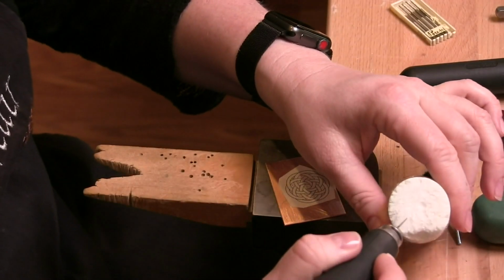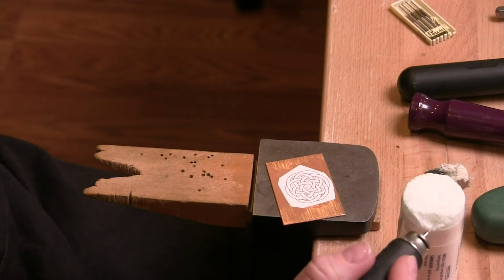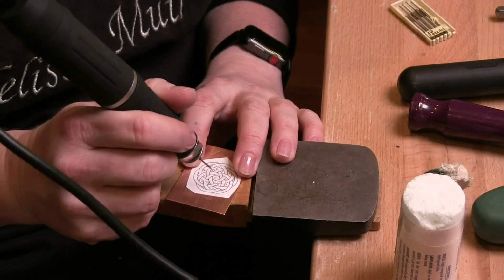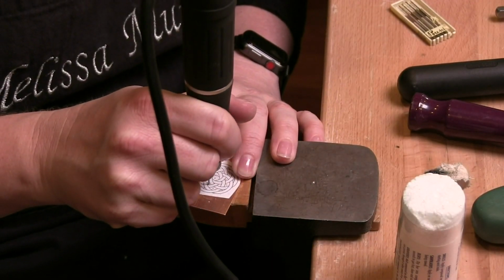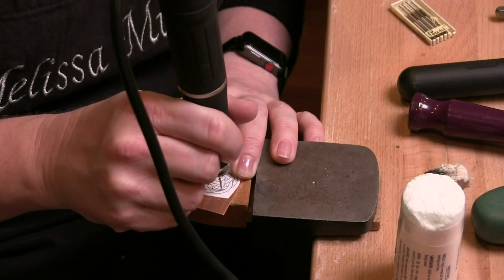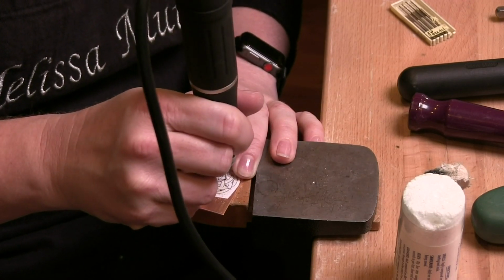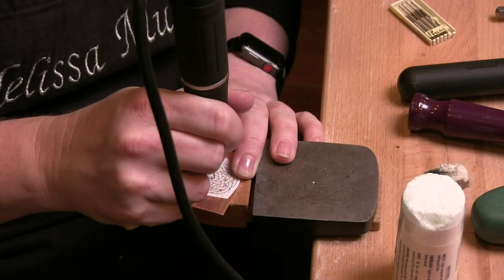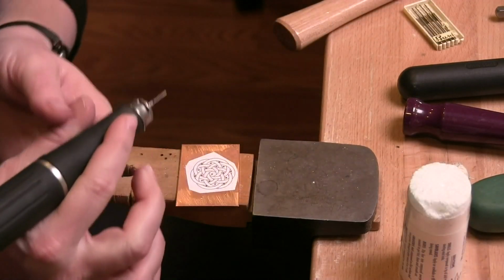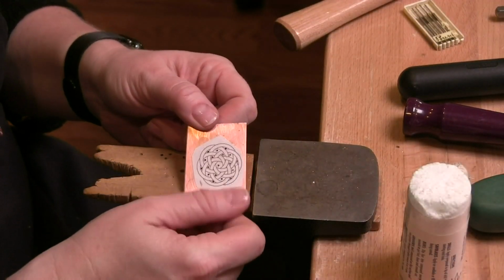Now when I do this, I also want to put a little bit of burr lube on. Also make certain that you are wearing your eye protection. I'm going to pull this down here onto my bench pin, and I'm just going to come right in and just kind of drill right down into that metal. And this is where it comes in handy to have that little divot so that it does not skitter out of it. And now we're ready to go.